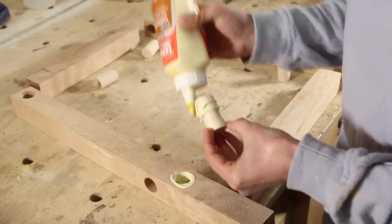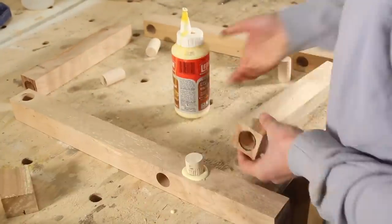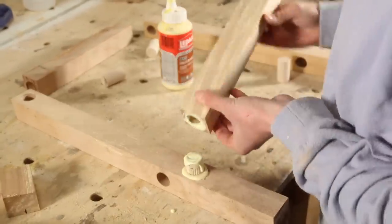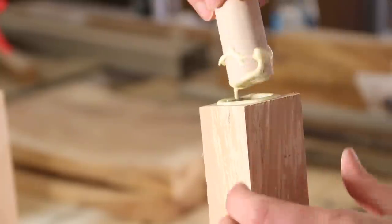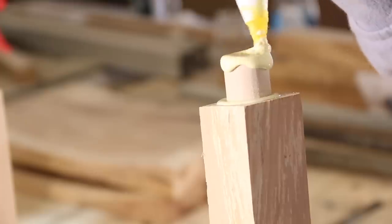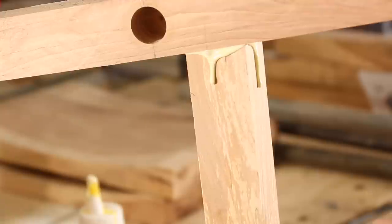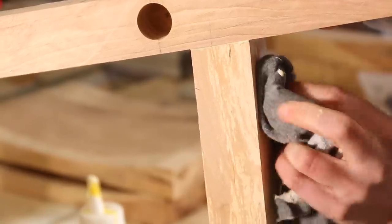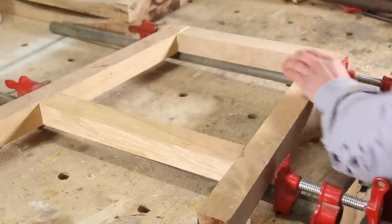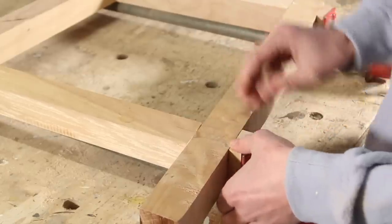Keep in mind that your front and back pieces and all of their holes need to be identical in order for your stool to be square. I used, probably way too much, LePage wood glue to assemble and then clamped my stool together. Since I was trying to clamp 5 degree angles, I cut little blocks that were 5 degrees on one side to make it more square and easier to clamp.